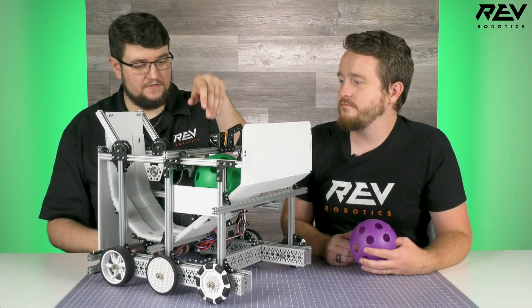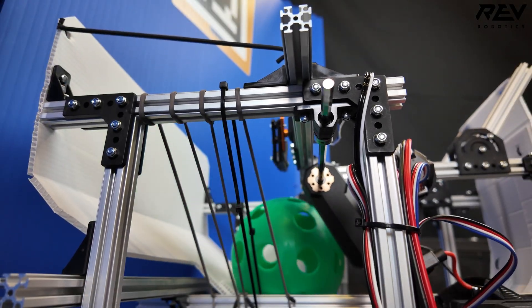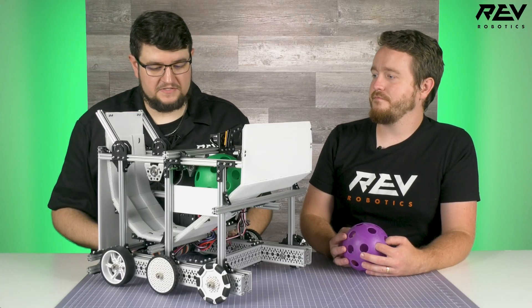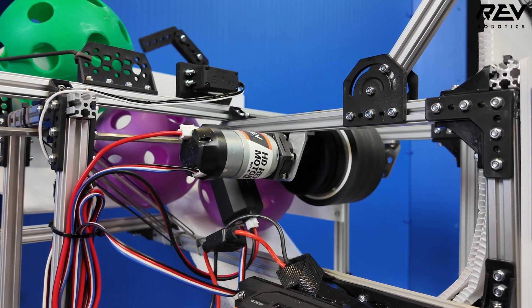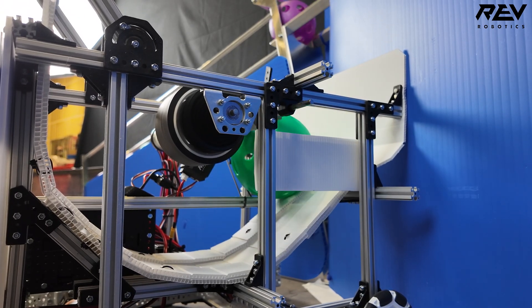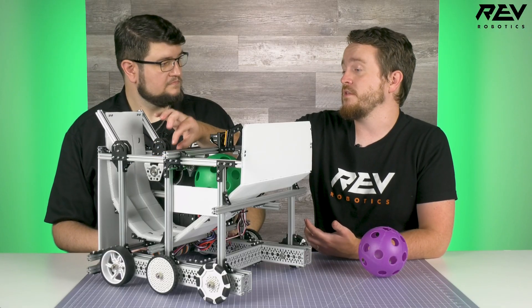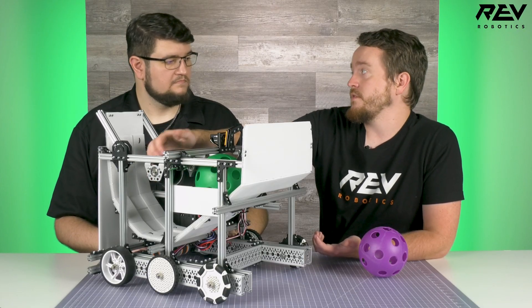This is a core hex motor, and that lets you control when you're pushing the artifact into the next stage — the launcher — which needs to be spun up beforehand. We've added some gears to the shaft of the launcher to give it a higher moment of inertia. Moment of inertia is basically a function of how much weight you have as far from the axle as you can get it. Since the gears are pretty large in diameter and the traction wheels are also large with almost all the weight on the outside, it adds a really high moment of inertia so the flywheel can keep a consistent velocity as we're shooting artifacts.